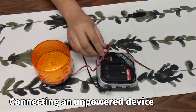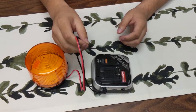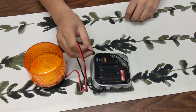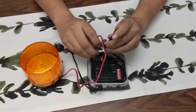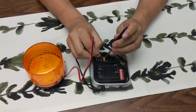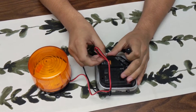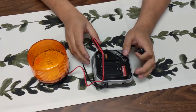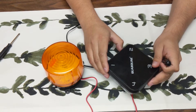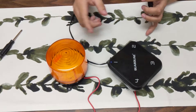So let's connect our strobe light here to our receiver's relay. We're going to do that by connecting our black wire or negative wire to our negative output, and our red wire or positive wire to our positive output. To do so, we're going to push down this orange tab and feed in the wire. Once it's all the way in, release the orange tab, and then do the same thing for the positive wire — push down the orange tab, feed in the wire, and then release. Just give it a light tug making sure it's all the way in there; it shouldn't come out if done appropriately. Afterwards, we're going to flip over our receiver, turn on our receiver and activator sensor, and you'll notice that our strobe light turns on.